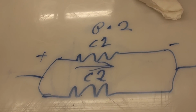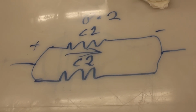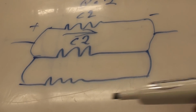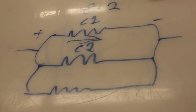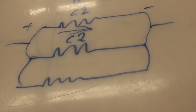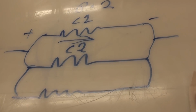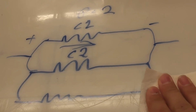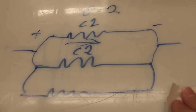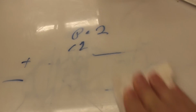Okay, so this is not how these cells react. You can't just add another one and then get more and more hydroxy out. It'd be nice if it worked that way, but it doesn't. So all you do in the hydroxy world is increase your surface area. You do not change your resistance if you're using the size of plates we use. So it does not work this way. I hope that you can understand that.